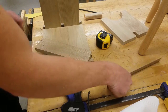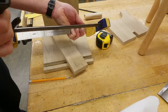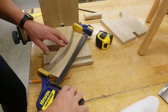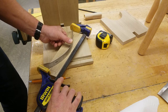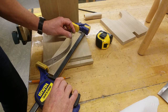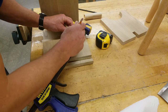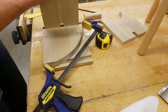Now you're going to bend your roller like this, and like I said before, I don't have an additional person, so I'm going to use a clamp to bend this roller. Okay, and then once I get that roller bent to the right angle, I'll trace that line. Almost there. There it is. Oh, pulling a little bit too much. Got to relax it. There it is. And now we're going to trace that line to touch all 3 points. Now if you push real hard, it's going to bend the roller, so just nice and easy. So then you want to touch all 3 points, and then it's time to cut that out on the bandsaw.